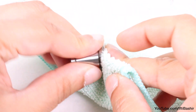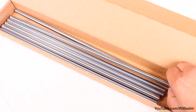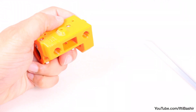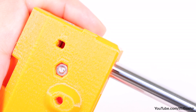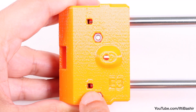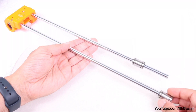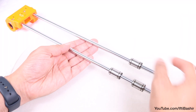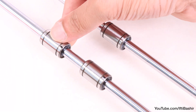With bearings prepared, we're ready to install our first set of steel rods. You'll have three sets with varying lengths — for now we want the longest set. Proceed to give them a quick wipe down with a paper towel to remove any machine oil and grease, before inserting the end of each rod carefully into the X-axis idler, trying to keep them as straight as possible so as to not damage the 3D printed part. These need to be pushed in as far as they'll go. You'll find a handy viewing hole on the side of the idler where you can check to ensure the rod has been fully inserted. If you lose any more than three or four of the tiny ball bearings from inside, you'll need to purchase complete replacements, so slow and steady is recommended.